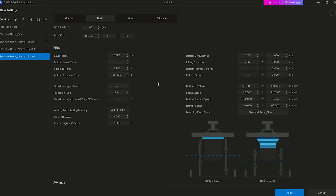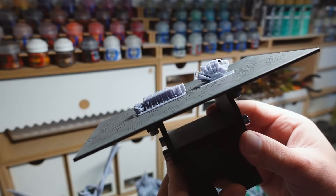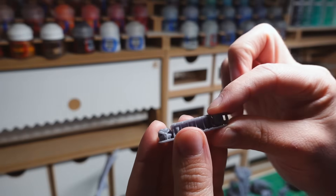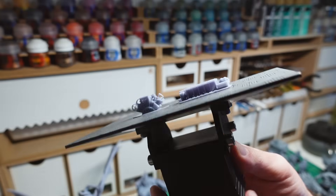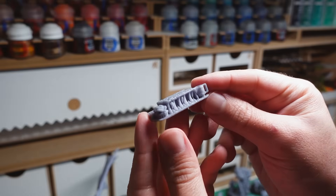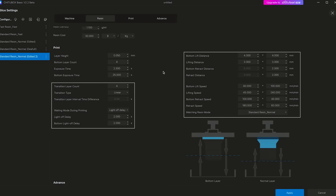Next is the exposure setting for the normal layers, the ones that make up the majority of the print. The goal here is to get the resin as hard as possible while still maintaining accuracy. To do this, there's a bunch of tests available that can help measure exposure, each with its own instructions on what to look for. So choose your favorite, or do what I did and print multiple. Here you can see my first cones of calibration test failed, so I made a small adjustment, reprinted, and got a successful result. The rest of the settings primarily deal with the way the printer lifts and retracts the build plate. Default settings should be fine here, but if you want to be cautious, you can tweak some of the numbers, sacrificing a bit of speed to help guarantee a successful print.